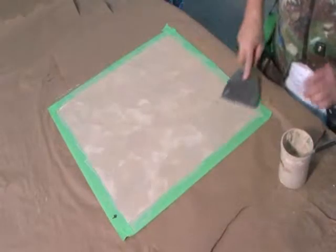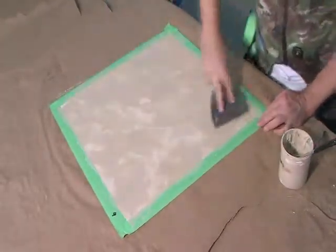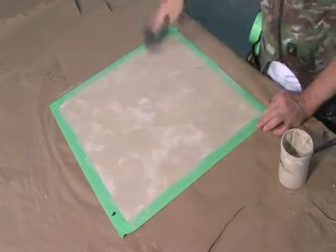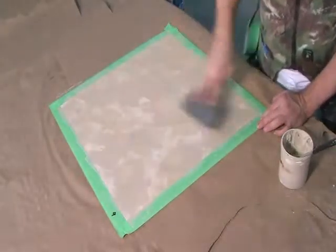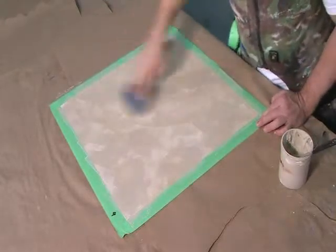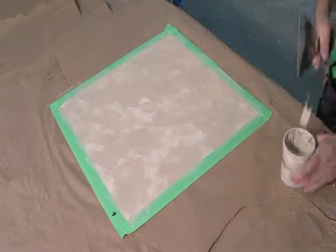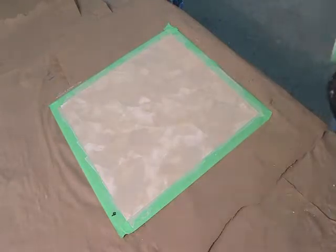Polishing is only to cause the plaster to add dimension through a tonal change, which only happens when the plaster is rubbed. This plaster has an earthy appearance and a matte finish. If you desire a high sheen, then coat the surface with Dura Gloss for protection and sheen. Greenstone is available in any color and may be applied in a single color or combination of colors.